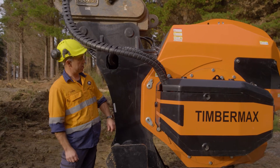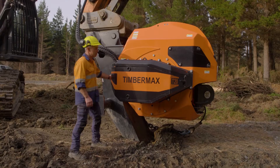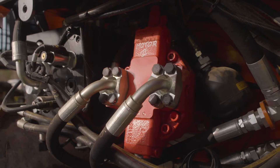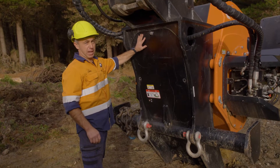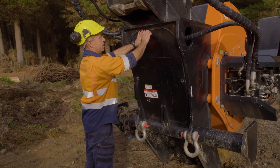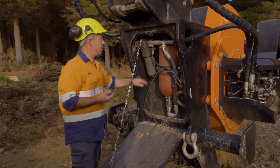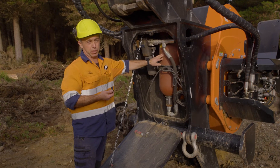The winch is connected to the spade with four pins, two on each side. Nice big panels open up to gain access to the control valves and to the winch motor — lots of access, very easy to get at everything. The winch spade has a high pressure filter in it, and we gain access for servicing by simply opening up the nice large panel. Also in the spade is a large 25 litre accumulator for supplying hydraulic oil to the winch.